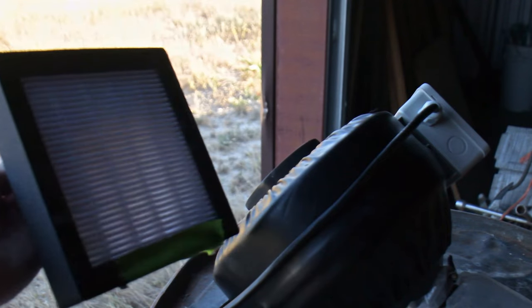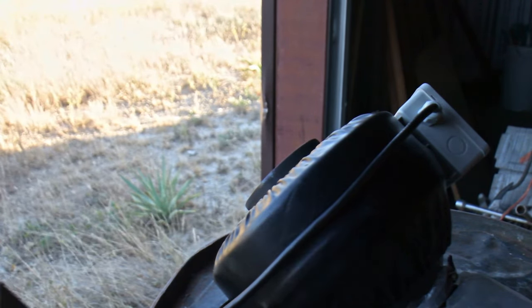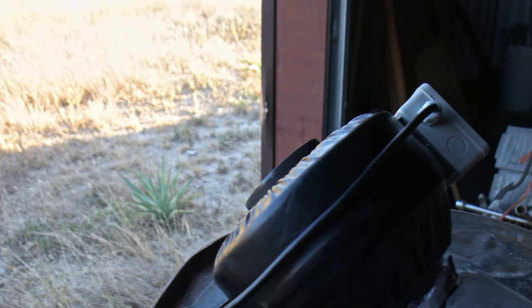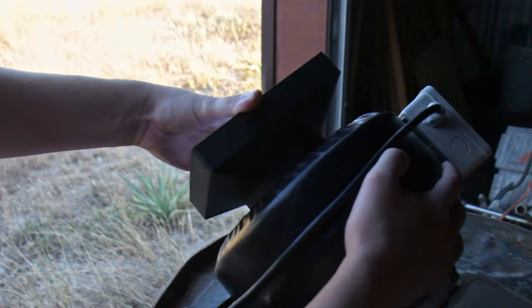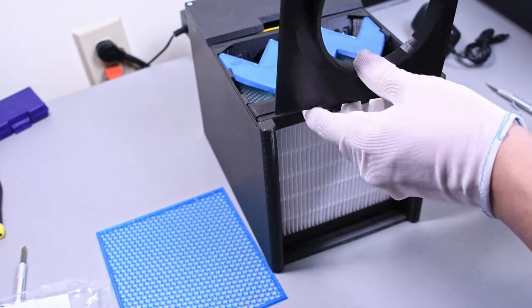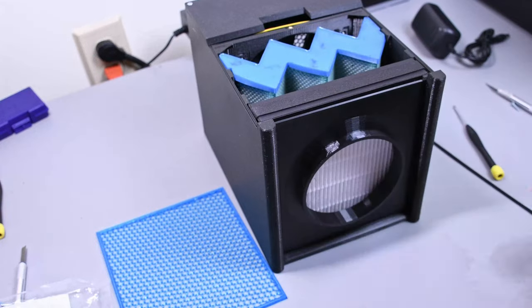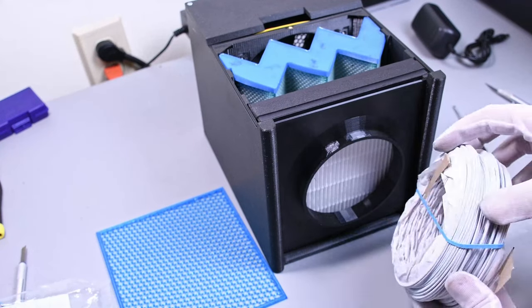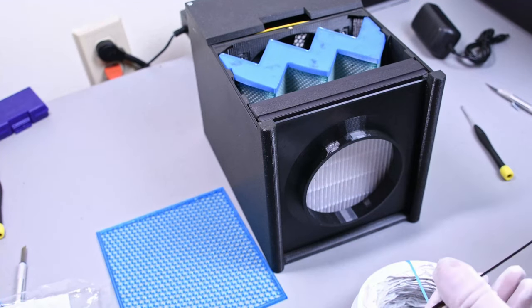I am currently using a 6x6x1 inch HEPA filter, which is affordable but has a lower surface area than alternatives. The filter sits in a reducing adapter right onto the fan. You could also 3D print a filter housing to connect your duct to — this system, by 4D Filtration, is free to print yourself or you can buy components from them.